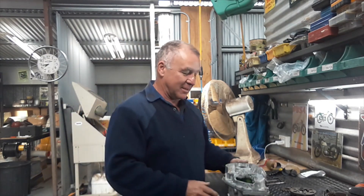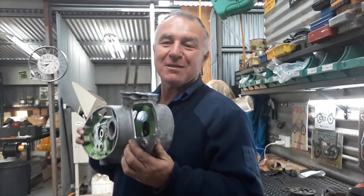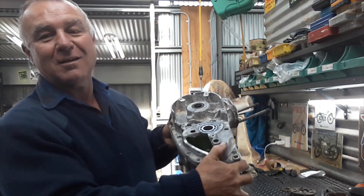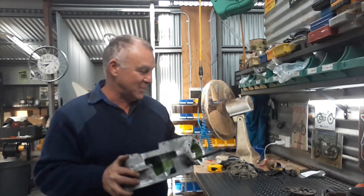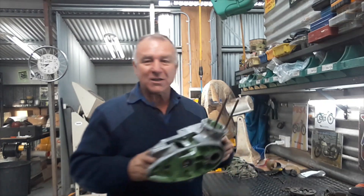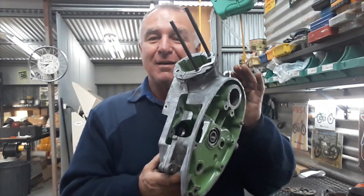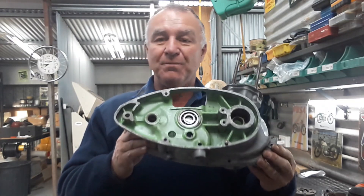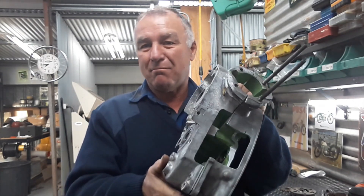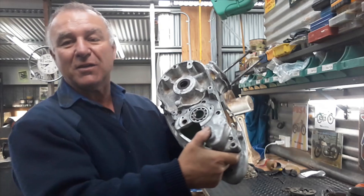There will be some people that will be absolutely horrified to see this, but here it goes. This is what I've been doing to a Bantam engine - sectioning it out so you can actually see the internal workings. This engine was inherited when I bought the business and someone had used a reciprocating saw and just gouged it all out. So I've set it up in the milling machine to do a bit more of a neat job. It was already painted on the inside and they'd made some headway, but I'm just finishing it off as a bit of a project.